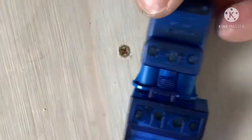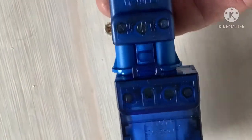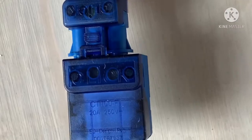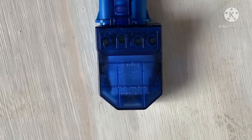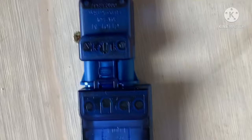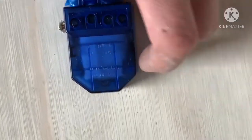These little click junction boxes have been out a while and they're absolutely brilliant for downlights, especially commercial ones. A lot of domestic downlights have their connection box on the back of the can, so there's no need for these. But I started using them when making up multiple downlights, because the old way you had to terminate in the can and there was never enough space. You had to make them up with one cable. These take your loop in and out - switch line, neutral, and earth - and will take up to three 1.5mm twin-and-earth cables.